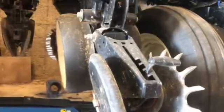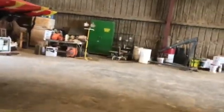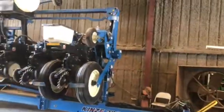So that's why we're going to a 20-inch planter. And so then it comes down to the corn head. This corn head here will have to go, and we wanted a bigger corn head anyway. And the 12-row wouldn't work with this planter because we tried that, and it didn't line up right and made a mess.